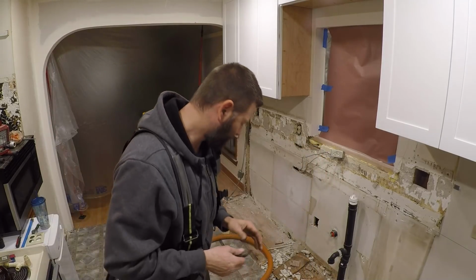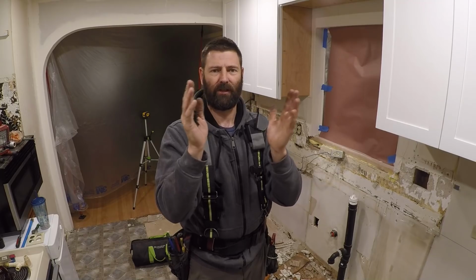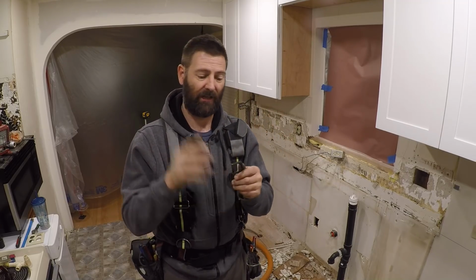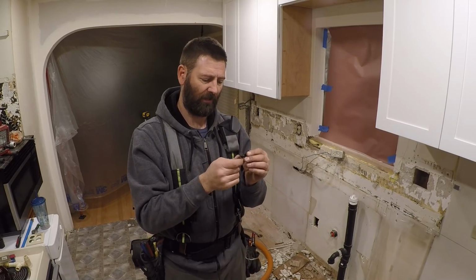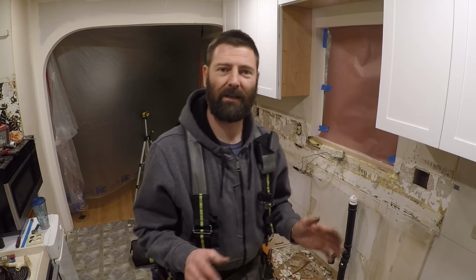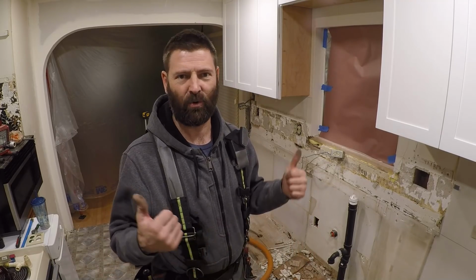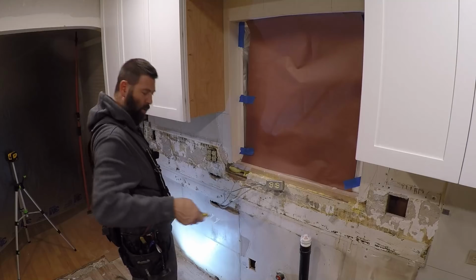What I did was pull the flex line back several inches on both of them and snip it off. The insulation on that part was intact and relatively flexible. It's all buttoned up, and their furnace works tonight. That's the important part. In the future, all this electrical is getting torn out and all new going in. Probably should go wash my hands.